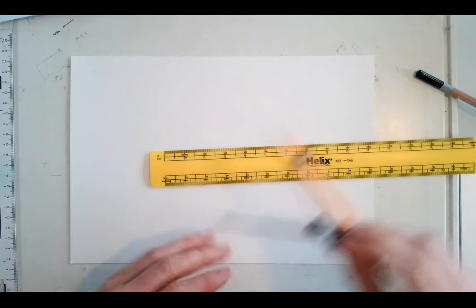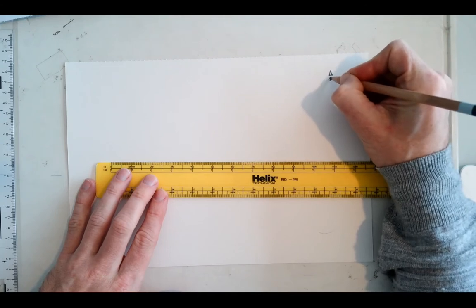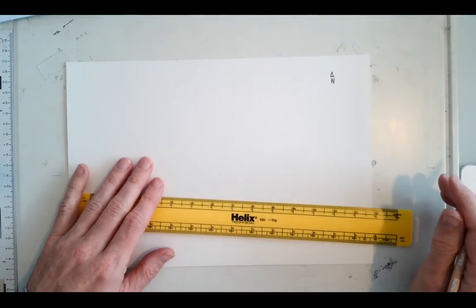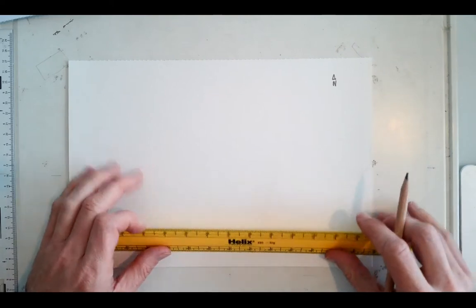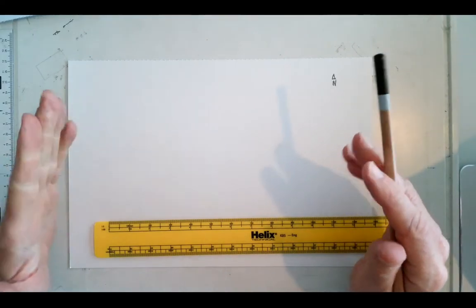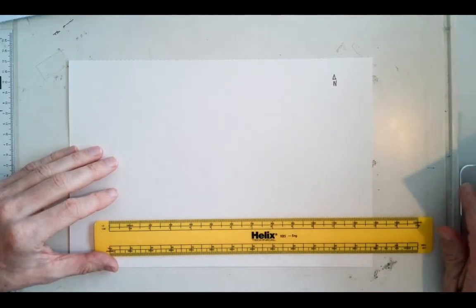First of all, we're going to start with our baseline. Always mark the drawing with a north point, or the north direction, and then try and get your baseline as one of the lines corresponding to the north. You might have to look at your reference sketch for that. Make sure when you're positioning your drawing that it is centered on the page. You might have to do a quick check of what your overall width and height dimensions are, and just make sure it fits in the page. You don't want part of the drawing going off the page because you'll lose marks for that.